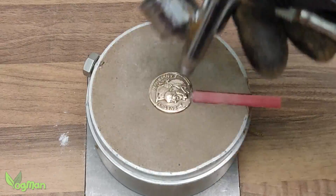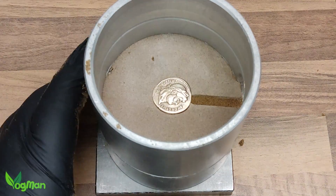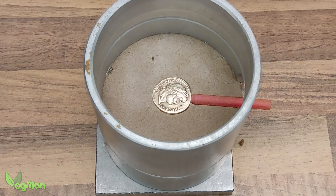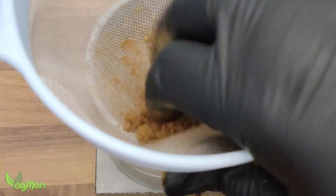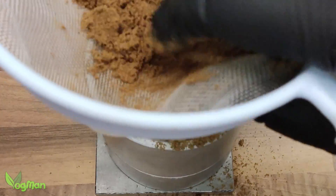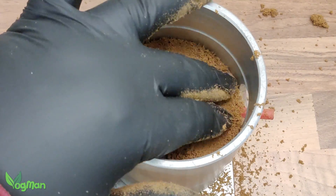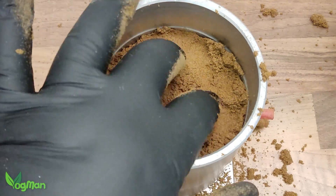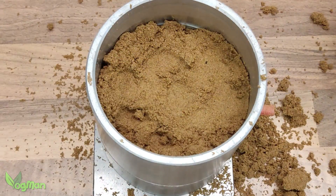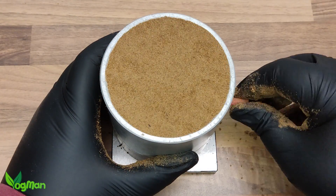A little more baby powder is added. As the wax sprue is a little long, I needed to remove it for the moment. The other flask is carefully aligned and slotted on, then the wax sprue was gently replaced. I recalled my adventures with green sand casting and using a fine sieve, I scraped sand through it. My logic is that the finest sand will come into contact with the pattern, helping me obtain better details. This gets gently pressed down and then more sand is added and compressed. Some sand will try to push free of the flask access hole, but this is easily compressed back into place around the wax sprue. Once fully filled and scraped level, the wax sprue is gently twisted and pulled free.